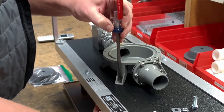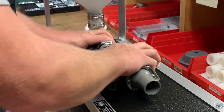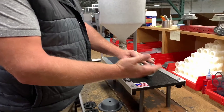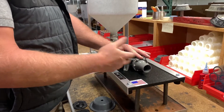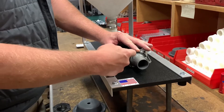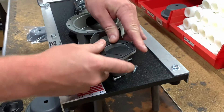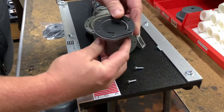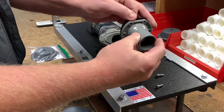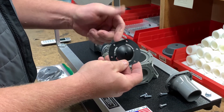A little trick of the trade: take your flathead screwdriver, hold your nut head against the cap screw head to get it off. From there you can take off your pump body to replace your flapper valves. Take the nuts off with your flathead screwdriver — there are six in the front and six in the rear. Drop your screws and don't lose your hardware.